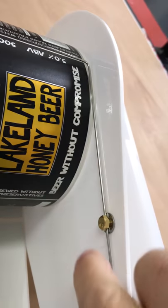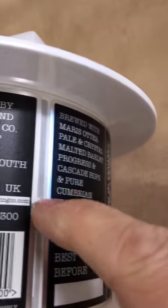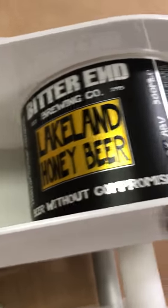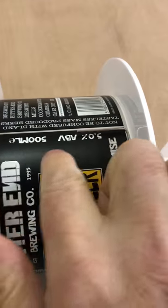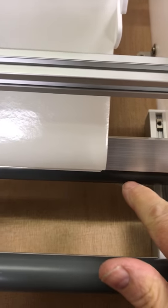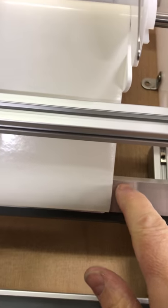Everyone's labels are different, so you might have to bend this bar. Ideally you get it lined up to a gap, but because these are big labels with this one, we just line it up to a mark on the label. Keep that pressure on — that's important. And setting up the gap here so the bottle touches both rollers but doesn't touch the peel bar.